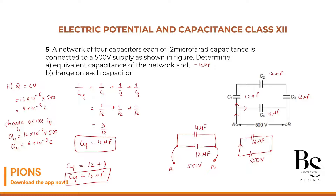Out of the total 8 × 10⁻³ C, if 6 × 10⁻³ C goes through C4, then 8 − 6 = 2 × 10⁻³ C goes through the upper branch. Since C1, C2, and C3 are in series, the charge is the same across all three. So Q1 = Q2 = Q3 = 2 × 10⁻³ coulombs, and Q4 = 6 × 10⁻³ coulombs.